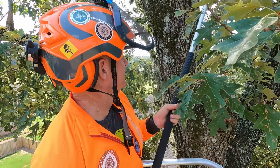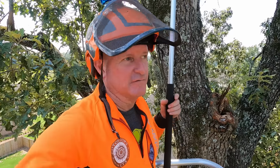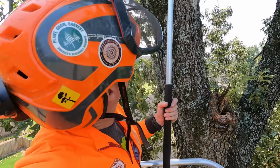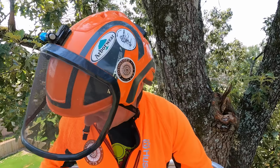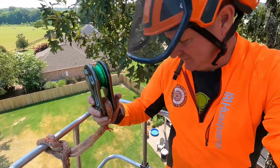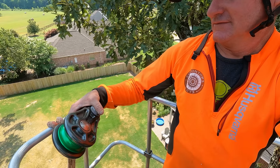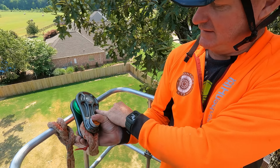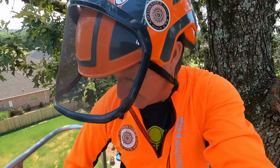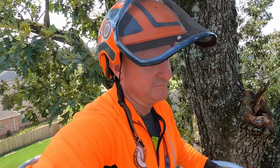So we're going on up. And hang on just a second. About to set one of my pulleys. I call it a pulley. Some people call them blocks, you know, but I call them a pulley. I got two of them in here. I've got my medium size one, which is this one. I think it's a working load of 40 kilonewtons. The MBS on it is 200 kilonewtons. So a kilonewton is 225 pounds, so roughly hold 40 something thousand pounds.